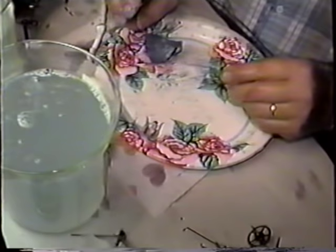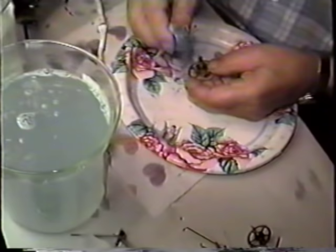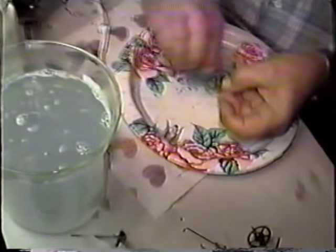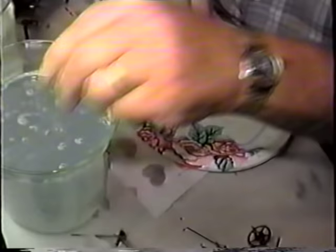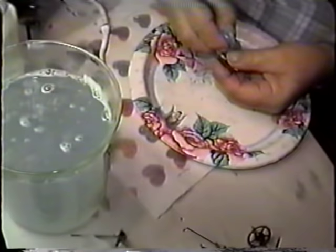On the strike side, I'll take my cam wheel and clean that and do the same thing. And then I'll also clean my warning and stop wheel. That's the one that has one pin in it. Do the same thing there, clean it, put it in a cleaner, and my fly. And we'll do that. Just scrub these real good. I'm only doing it quickly here so we can get through, and I can show you exactly what's going on with the rest of it.